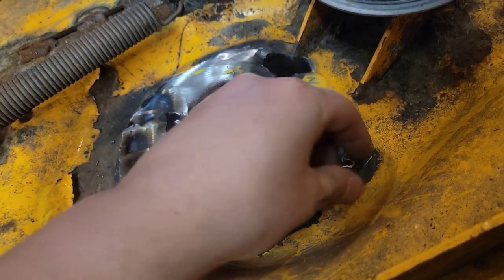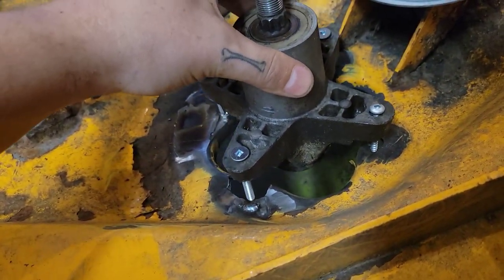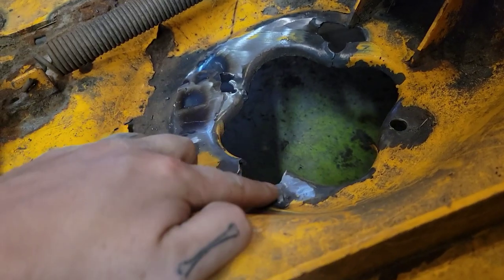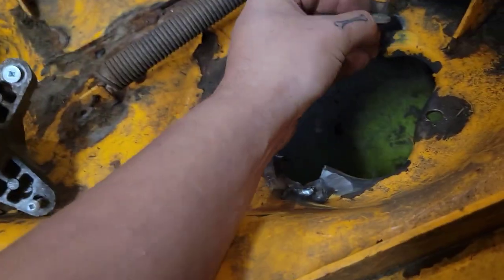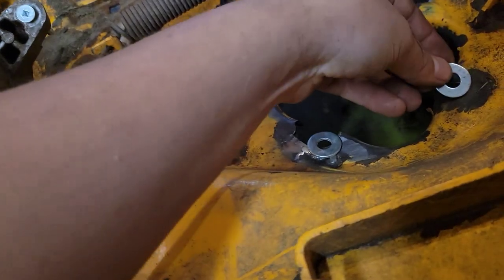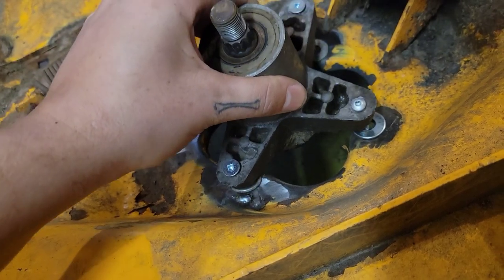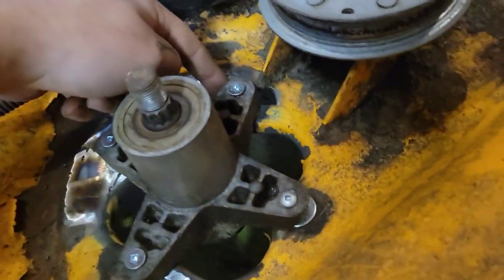Okay, so that will go into there. This is our little mechanism, and we got some feeler bolts so that we can find our position. But of course, we just have the one true hole, and then we have an estimation of these two holes, and then this one is somewhere in this area. So what I plan to do for structural stability and for alignment is I'm going to use some washers. Now, this one doesn't need one except as a spacer, because I want it to be the same height as best as I can do, because it might be critical. Now, if I put this back in there, I can now tack these into place once I figure out what that is.